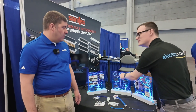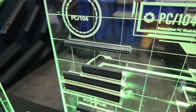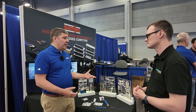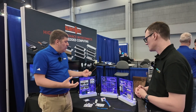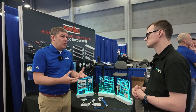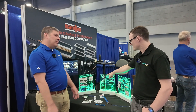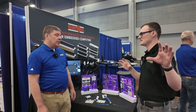It's amazing to see how a 2.54 millimeter pitch is still being used. Here at Embedded World there are almost endless SOMs and COMs targeted at specific applications. ComHPC is the bleeding edge, but companies like VersaLogic are continuing to drive PC-104 solutions because their customers are still demanding it. Some of those solutions were designed into military systems 20 years ago. If you need a new board with a new Intel chipset, you can still leverage the same PC-104 interconnect infrastructure you designed in 2005.